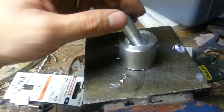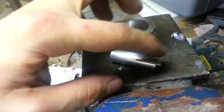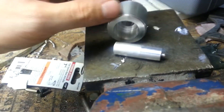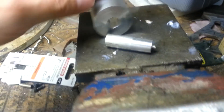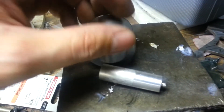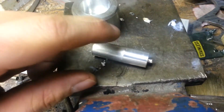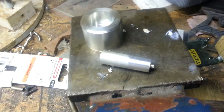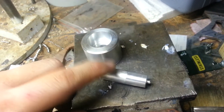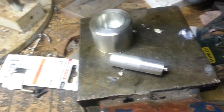Here's this 500-degree piece of aluminum — one degree taper turned into the end, half inch straight, one inch taper. Here's this little cuppy thing, also still 500 degrees-ish, probably 300 or 400. Little one degree taper in the end there, one degree taper on this side. Separates well, though I wish it would come off the central part a little bit easier, but it worked just fine. No actual complaints. All I have to do is use stock that's bigger than a half inch and taper it all the way up, and the zinc piece would release just fine.